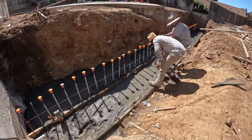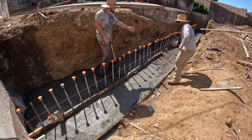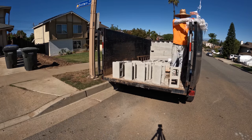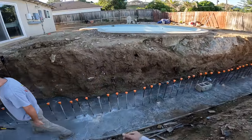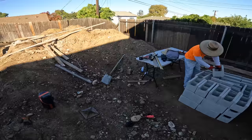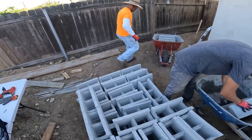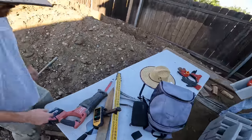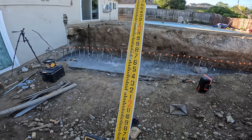You can literally see us walking on top of the footing right now, still just trying to get the middle form out. The main thing we're trying to do is smooth out the foundation top surface so when we came back the next day we'd have a nice level surface to set our block on. So we poured out the foundation yesterday. We're bending some of the rebar back into place since it moved a little bit during the pour. We're also bringing in all the block — all hollow blocks — because there will be rebar in every single one of these courses, horizontally and vertically. For right now I'm going to set levels for this block wall so we know where to start building everything.